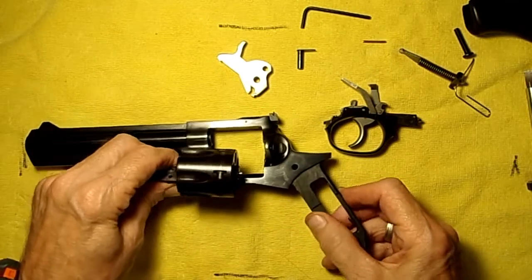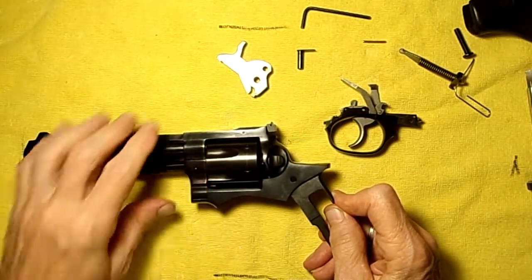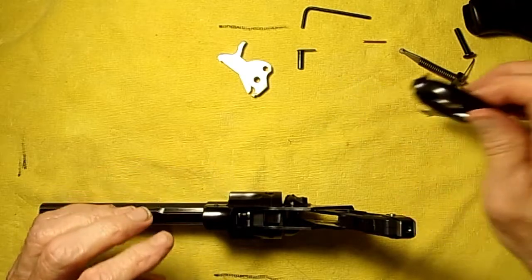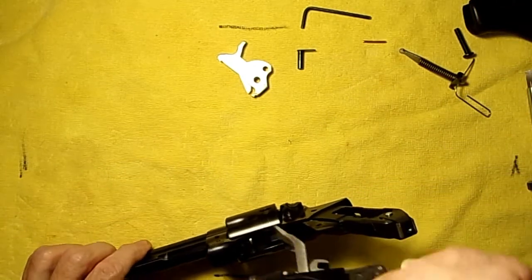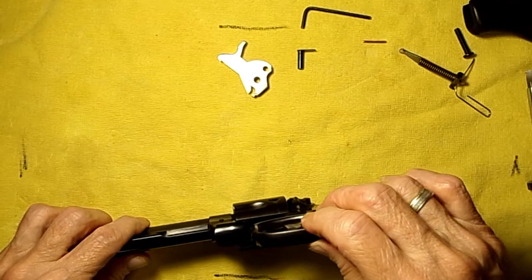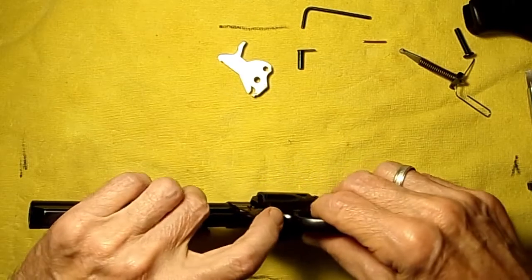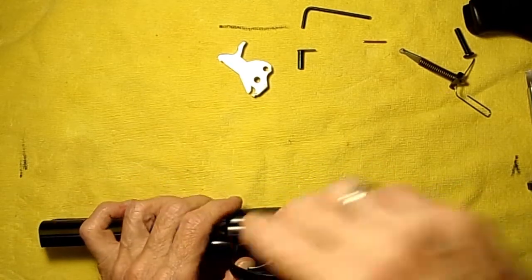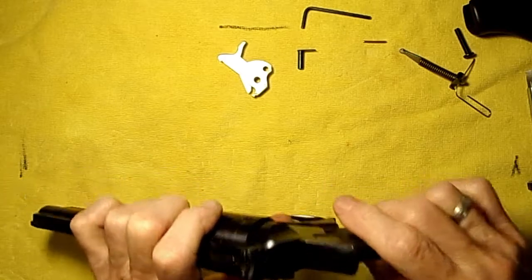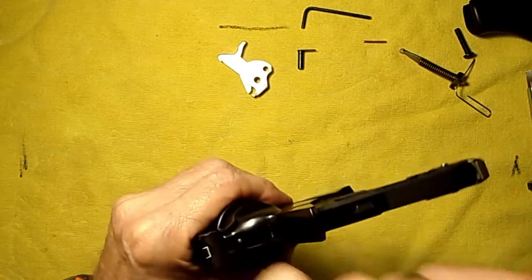This slides in. Now this is your cylinder and crane assembly. Again, lock it in place, make sure everything goes around good. Now here's the trickier part, is to get everything that you got there that sticks straight down in this at the right angle. And what I do is I get it so it's touching here, and then I turn it upside down, or I turn it right side up, and look inside and make sure that the transfer bar is right there. It is. The transfer bar.